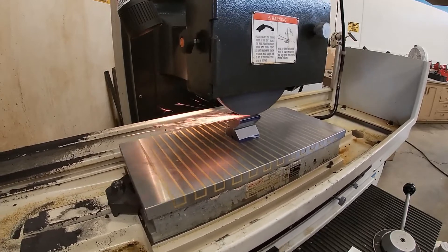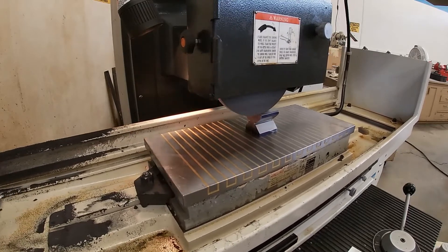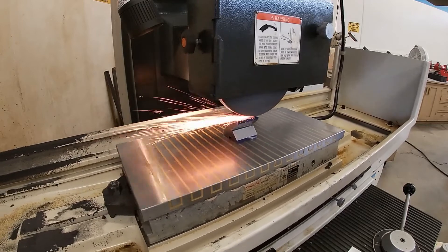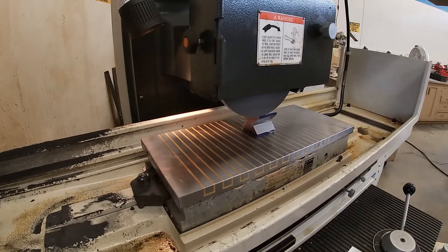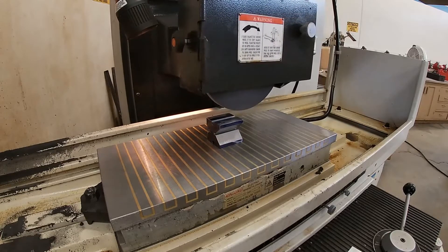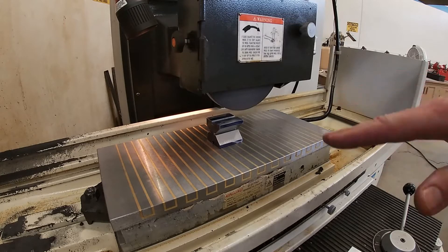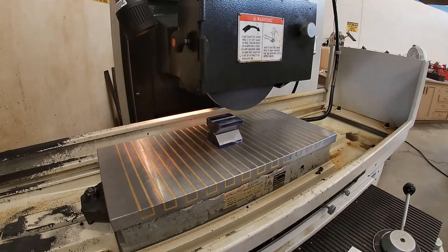So this side of the part, despite the fact that it was not rocking when I put it down on the chuck, it's clearly higher up than the other side where I touched off. The part appeared to have pretty parallel surfaces and it wasn't a big amount grinding off — just on this far right side closest to me. But that's why we check the part with manual controls before making our downfeed adjustment and then start power feeding.